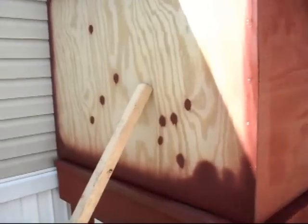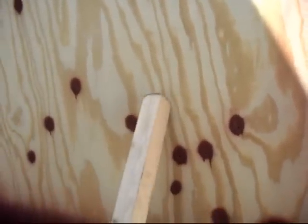So, not to make that mistake again, I put a quarter inch Luan in here and cut this 35 and 3 quarters instead of 36. Now she's wedged up tight up here. And the deck isn't perfect, so she's still off the floor of the deck. So what I'm going to do here is nail this into place right now and then take this piece out. Well, I got the piece in. Now here's a 2x2 that the roofers left for me.